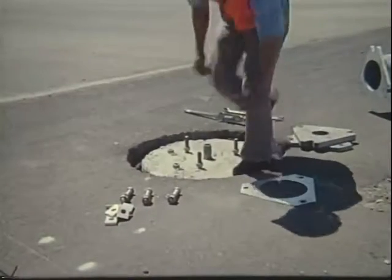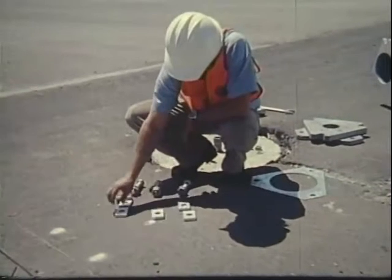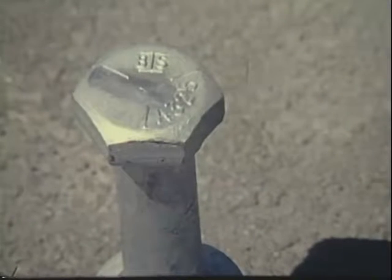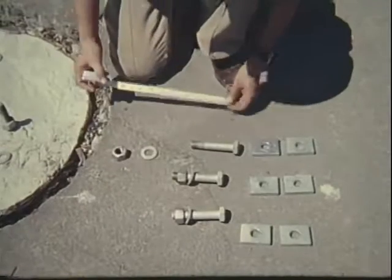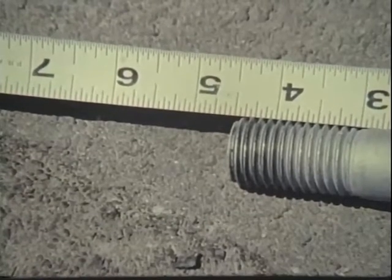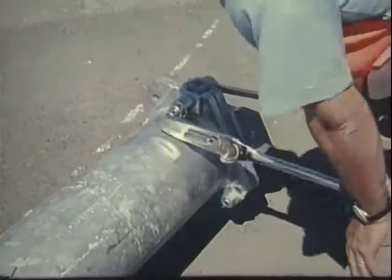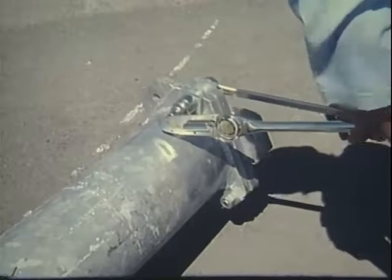The plate washers must be the right thickness — one half inch in this case — so they won't bend when the clamping bolts are tightened. The three slip base clamping bolts must be new A325 galvanized bolts with clean, undamaged threads. The clamping bolts must be four and one half inches long for the slip base of a Type 30 or 31 lighting standard, so that the bolts can be properly tightened. Nuts should be either ASTM grade 2H or DH, and the nut thread should have a good coating of dry lubricant.